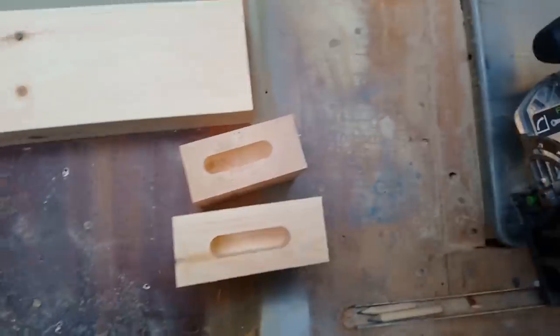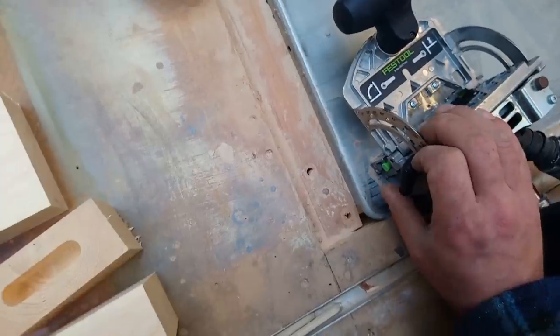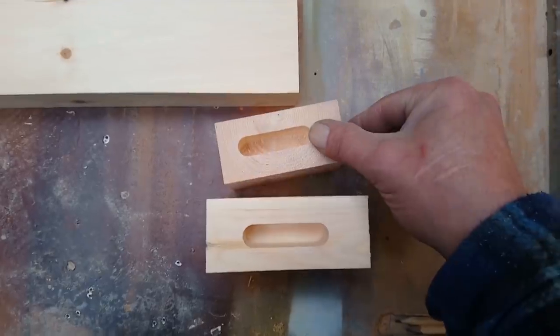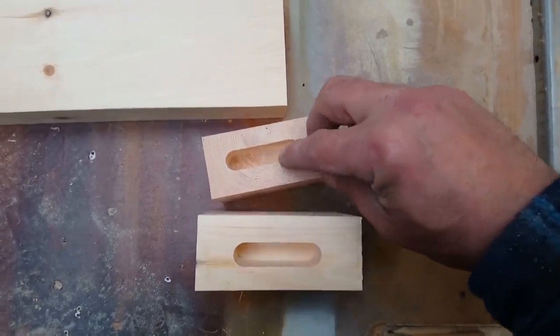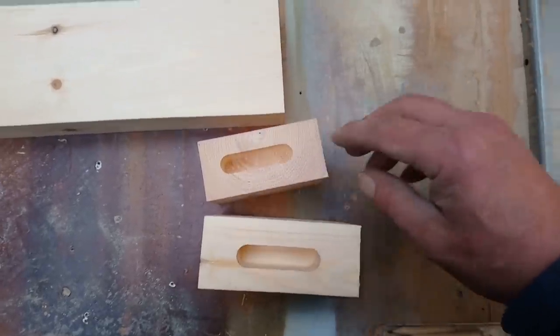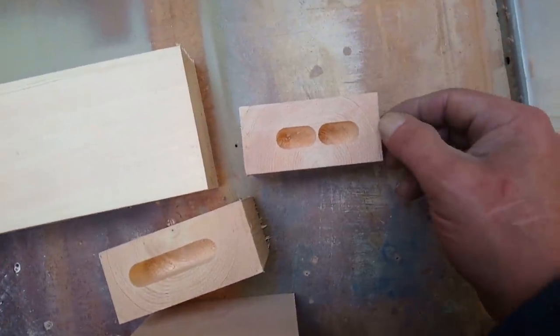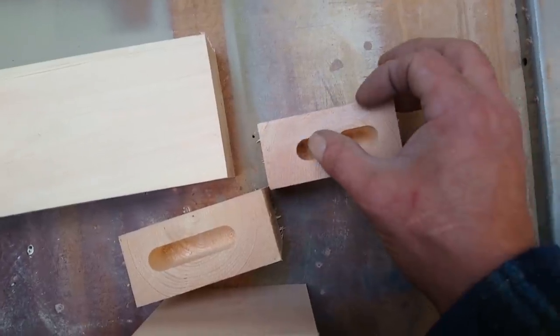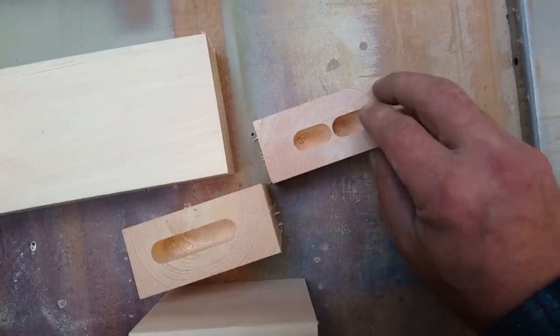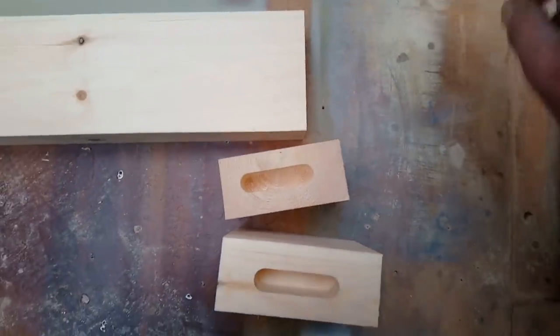And that is a combination of using first and second stop. So that's second stop, then first stop in the hole does the middle. Then second stop in the hole does the far end. See, that's the second stop, and then the second stop again puts me there. I need to take that piece out the middle, that's why I've got to use the first stop again.